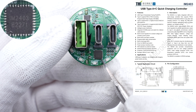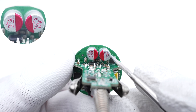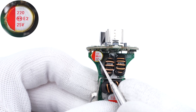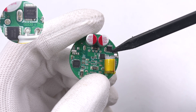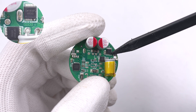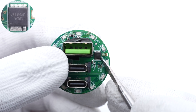The other protocol chip for USB-C2 and USB-A is also from Toll Microelectronics. It can support dual USB ports and a variety of fast charging protocols. The solid capacitors for output filtering are 220uF 25V, also from Shentong Electronics, wrapped with heat-resistant tape for installation. Two VBus MOSFETs are from Alepik Semi in a PDFN3030 package, used to control the output of USB-C1 and USB-A respectively, rated 30V at 5.5mΩ each. The same VBus MOSFET is used to control USB-C2.